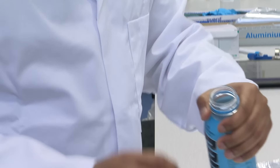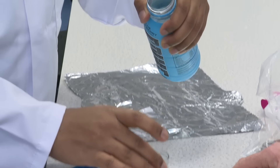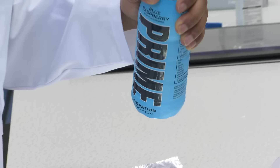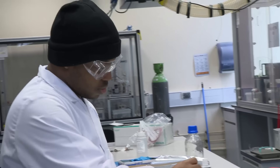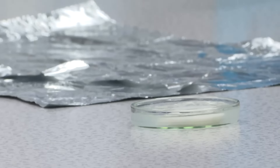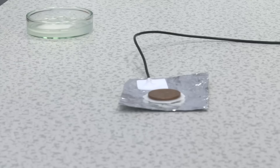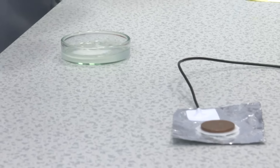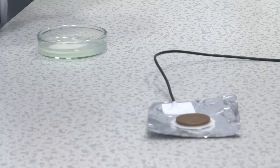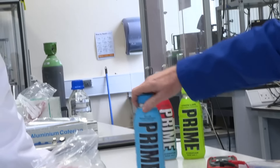This is an aqueous electrolyte, so this contains our ions in water. In modern batteries, not all electrolytes are aqueous — in our lithium ion batteries, they're not. So we're going to soak our separator in that and then keep building. Here is our electrolyte — the Prime soaked into the paper — and then the zinc and the copper are separated from each other. They don't touch directly, but we have an ionic conductor separating them. The ionic conductor in this case is Prime because it's got an electrolyte in it.